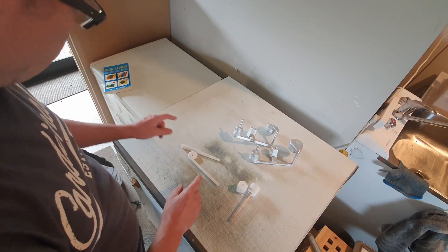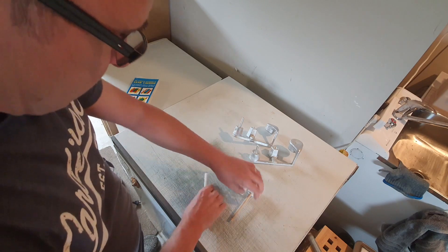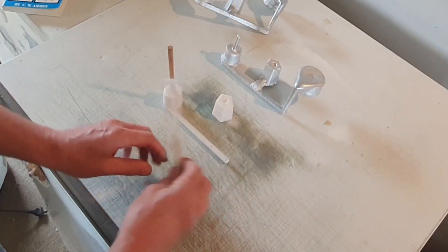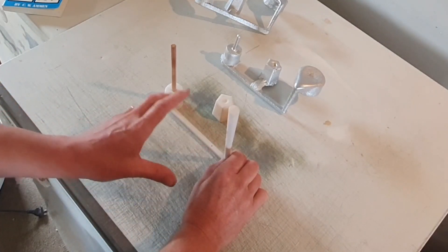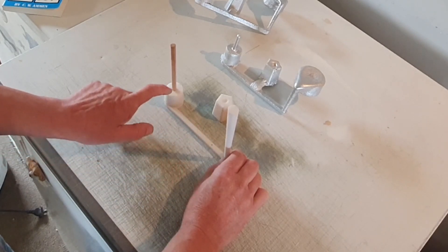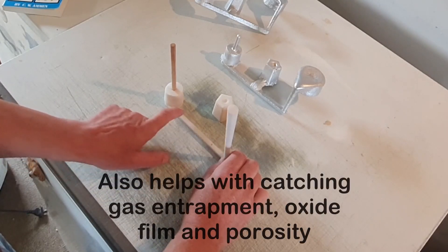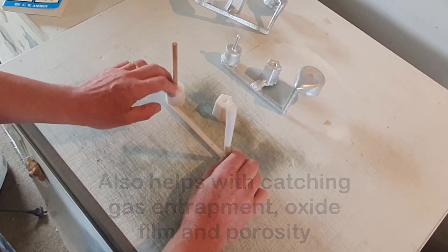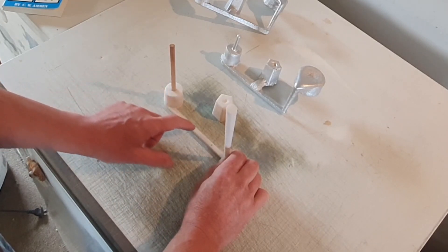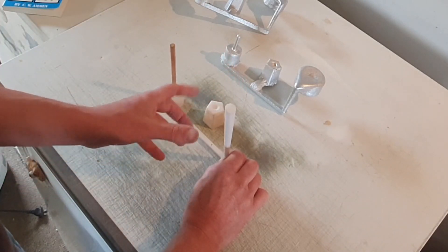From reading the book and watching videos on YouTube, I've used this type of setup — all 3D printed by the way. We create a mold in the sand using these items. We've got a pouring sprue here, then it goes into a runner, and then through to what they call a spin trap. The spin trap is supposed to catch the loose particles of sand. The metal gets poured down, comes through the runner, rushes into the spin trap, and as it fills up it starts to go through the gate and into the part we're casting.